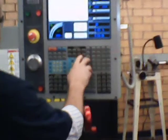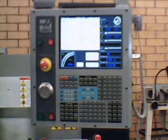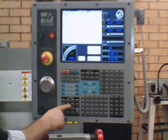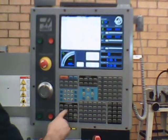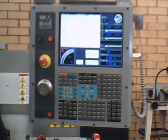So I'm going to restart it. We go back here now to current commands, and it tells us what the spindle speed is. If it could go faster, we could push this button right here and go up to 200%, but notice it just stays at 1999, 2000, and that's because it's the maximum on this lathe. Let's go back and look at the maximum on each one of these manual lathes so that you know how to calculate the spindle speed when you do your homework assignment. Okay.